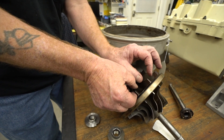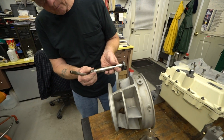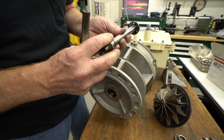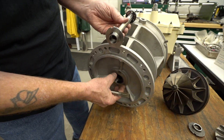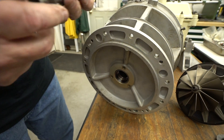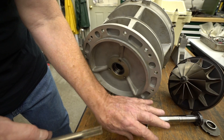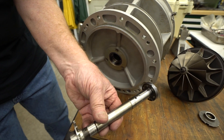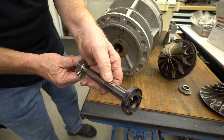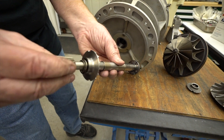And that's through the hot gas nozzle — it's burned right off of these tips. It's a gas at that point and not a flame. What you would see out the back would be this part. That oil slinger nut — there's a plate that screws on there that retains the bearing. The oil slinger nut will throw oil all against here and it will drain back into the main gearbox. This actually fits down inside — this is the drive shaft and it's splined down inside there, a special-made spline, and it screws into the shaft when it's made. And this shaft is locked in place by a lock ring.